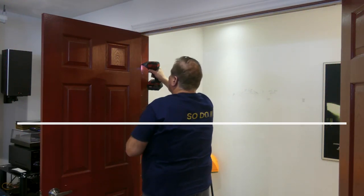So I used the opening for two 28-inch doors, which fit perfectly in the opening. So now the goal is, and I know I'm a big guy, I'm still keeping the 28-inch door, but instead of destroying everything just for 2 inches more, putting in a 30 or 32-inch door, what I'm doing is I'm keeping the 28-inch door on this side, and I'm not going to finish the wall on this side. I'm not going to be putting any drywall, and what I'm going to do is put shelving inside of the wall, as you've seen, an in-wall shelf that's going to be holding the DVDs, the CDs, VHS tapes, whatever, and it's going to give me a lot more space around because it's getting crazy, you know? So that is the goal of the little project here.